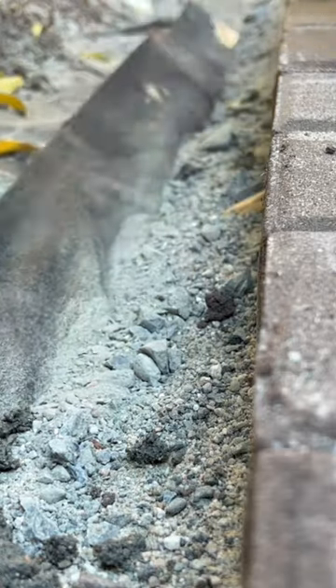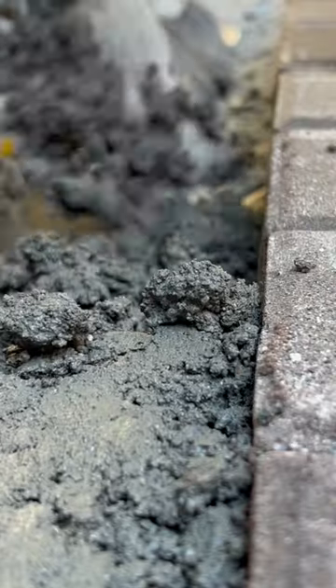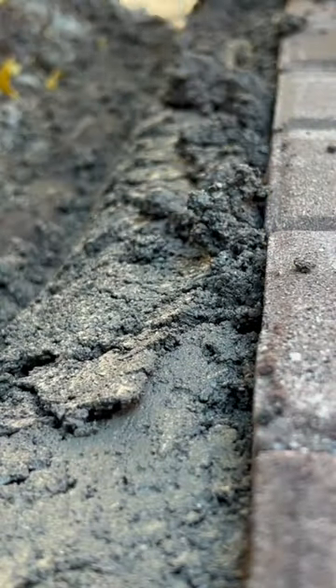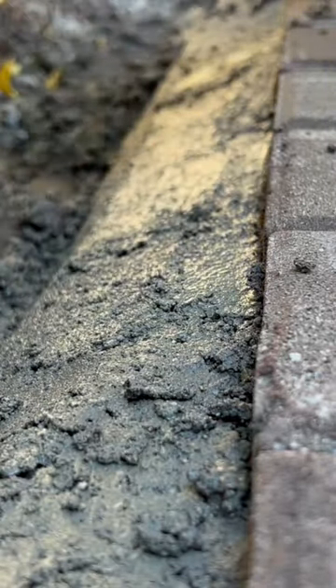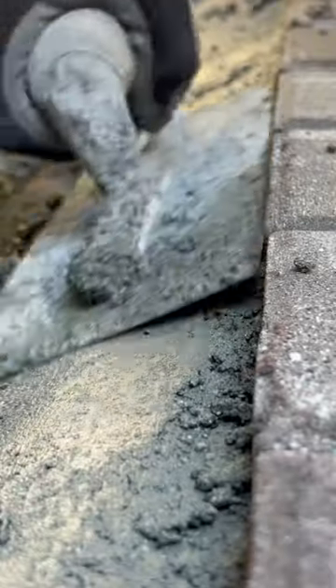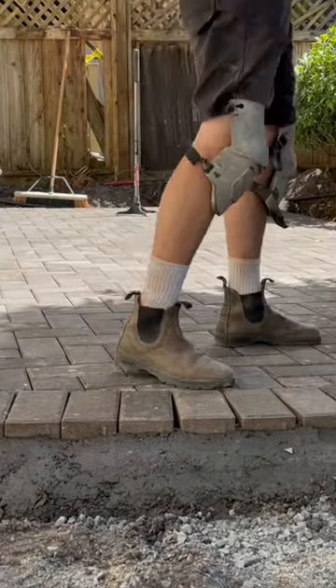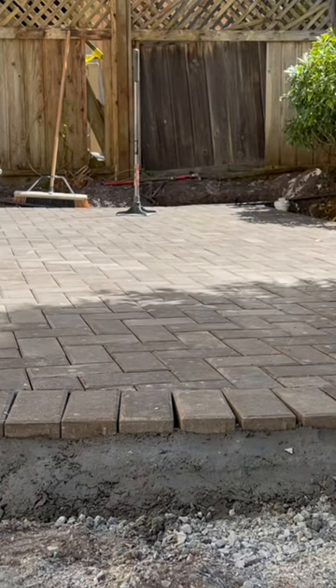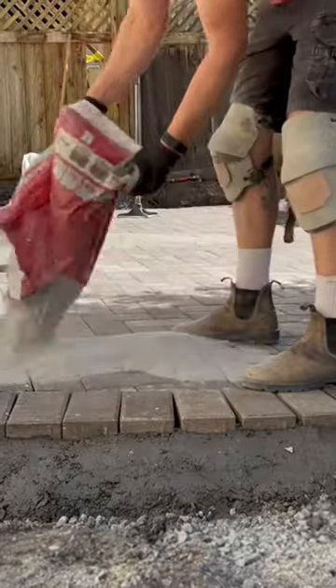Making the extra timing of those cuts really precise. As I mentioned in a previous video, the drainage is right on the edge of the patio, so I'm curving on the road base layer right beside the clear crush and perforated pipe system. That way, water is going to roll right off onto the curb and down into the drainage, which is pretty cool.